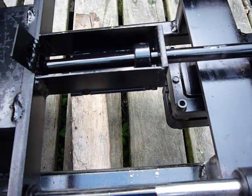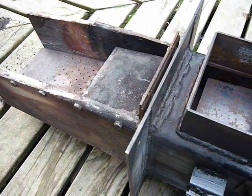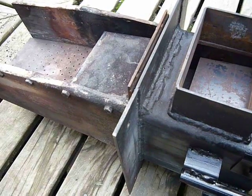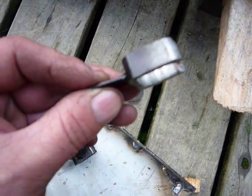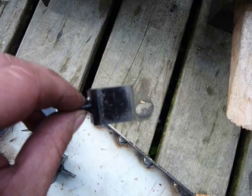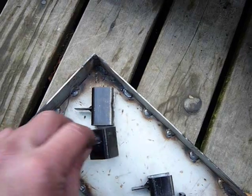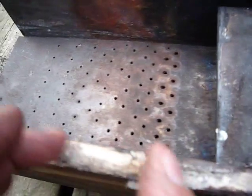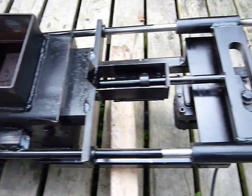The way it's set at the moment, it's set at idle, which will just give me a little bit of a red line along the back of the fire along the first line of air holes, but won't have any flames or anything. That one there — quarter — gives me about two inches of flame. That gives me about six inches. That gives me probably about ten to twelve inches. Interestingly, between the three-quarter and the full, there's very little change in the height of the flames, but there's a lot more fire — it's a lot longer down here, but your flames seem to be about the same height. So that works alright.